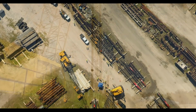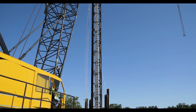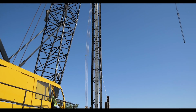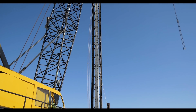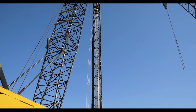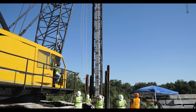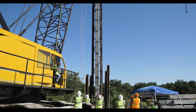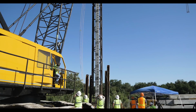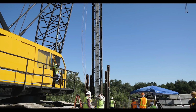The Lower Yard was chosen as the site for our installation because we had a full geotechnical report for the area prior to starting. This report would allow us to correlate our findings against the soils data for the area and present a complete picture of what was happening beneath the surface. In this test, two piling hammers were used, a D36 and a D62 respectively. We started the piling installation with the D36 hammer, as can be seen here.